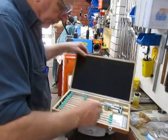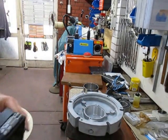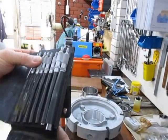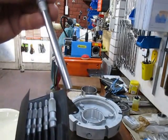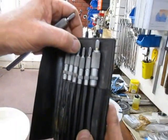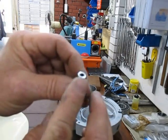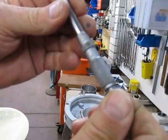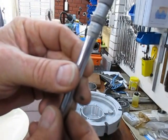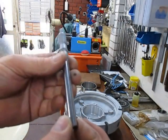While we're at it I'll show one more item — not required for this job, but this is also a Moore & Wright set: a set of internal ball gauges. This set goes from a quarter inch to half inch, and there are seven of them. They have little balls that protrude as you wind the screw up; they spread out, and then you measure with a micrometer. This one here is 0.375 to 0.5 inch, or 9.6 to 12.7 millimetres.